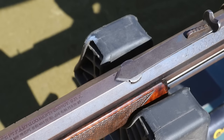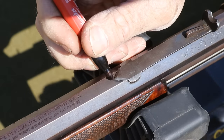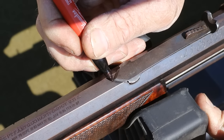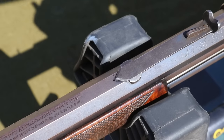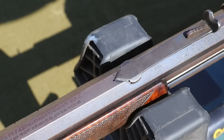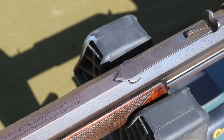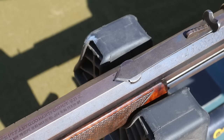In order to get a reference mark to see where our sight started, we're just going to use a black marker and put a slight little hash mark right in front of the sight. You're probably thinking — he's writing on his barrel with an indelible marker! Well, it'll come right off with a little acetone, which won't hurt the bluing at all. One of the issues when tapping a sight over is knowing both if we moved it and how far we moved it, so at least we've got a reference point to go by.